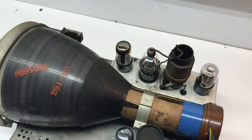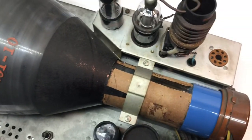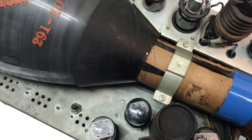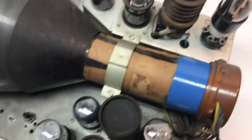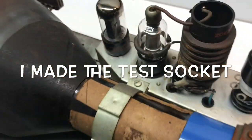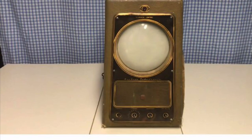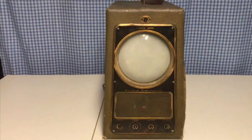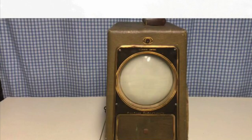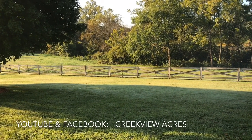Here's one place where these test sockets will really come in handy. With this test socket I can just plug it in here on top, plug the tube into the test socket, and check voltages, resistance, or whatever I want to check — right there with the pins labeled, pin 1 through pin 8. That's going to make it a lot easier. That's all the time we have for part 1 — stay tuned for part 2 when we'll do some troubleshooting on the chassis and see if we can get this set working. Thanks for watching — if you enjoyed this, hit the like button and please subscribe to our channel.